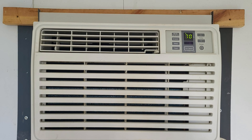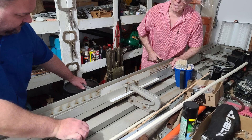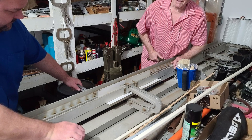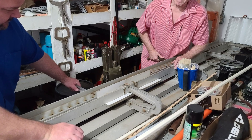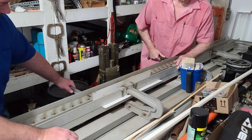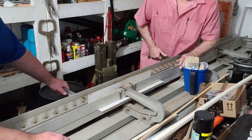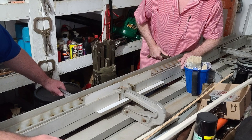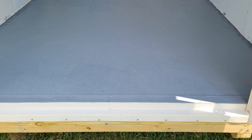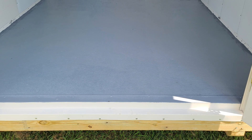Not quite done that day — we also needed to create a rain deflector for the outside. So we got out the old bendy tool and some aluminum stock that AC4DM just had laying around. My brother KY4CKP and AC4DM got to work, and we installed that on the backside of the shed. We also did some caulking on some of the gaps in the metal forming on the outside to make sure wasps and bugs couldn't get in and to provide a more airtight seal. The last thing we wanted to do was paint that floor with a non-skid surface — you can buy that porch sealer just about anywhere at your big box stores. We put down two coats of Elephant Gray.